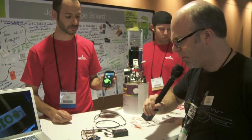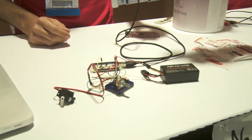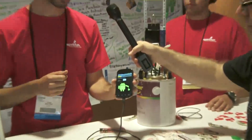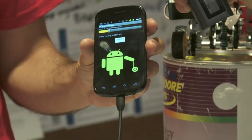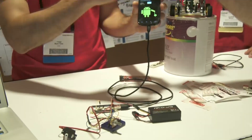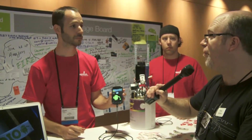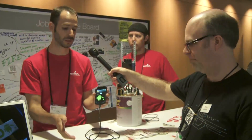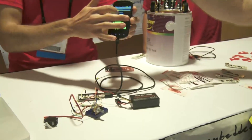Right here you've got a servo motor and a potentiometer, so you can make that motor move. Let me show you a quick demo. This is an app that I wrote. The nice thing about it — this app only required about 30 lines of code. It's really simple to write and it didn't require any embedded programming. It's just all pure Android code using a library that I'm providing. So you don't have to program the chip at all? No. That's different from the open accessory board as well. You have an extensive library that lets you control each and every function of this board.